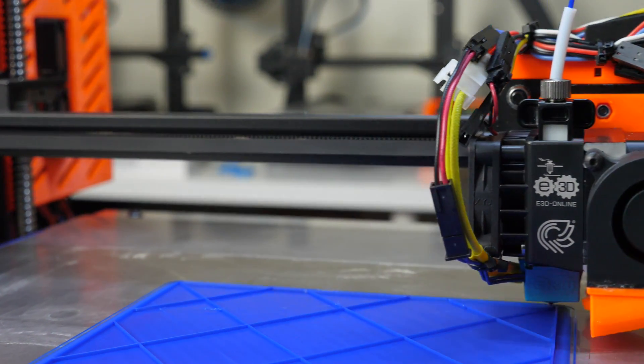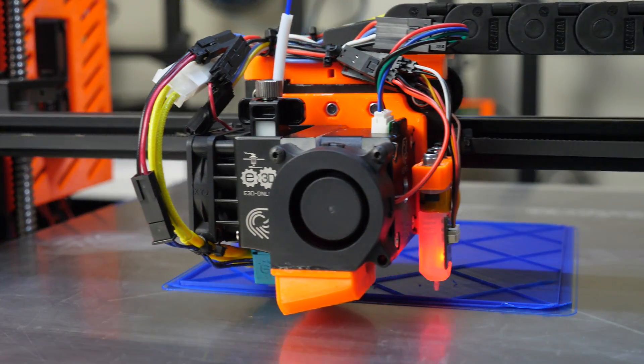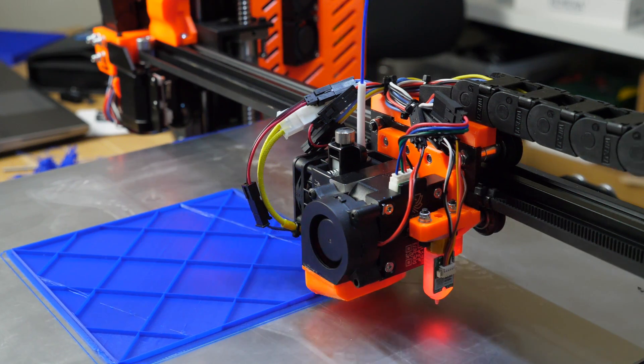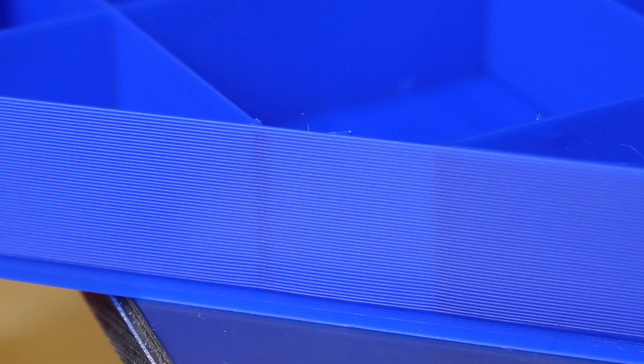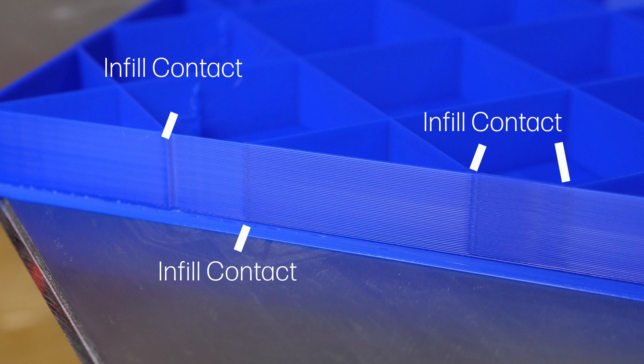The print took about 90 minutes, mostly due to a slow first layer, but the results look really good. The Hemera performed seemingly exactly as estimated — the fast straight perimeters are perfectly formed, except where there's some interruption from the infill and perhaps some under-extrusion due to my retraction settings. The printer hasn't been tuned at all, so only the speed matters for this test.